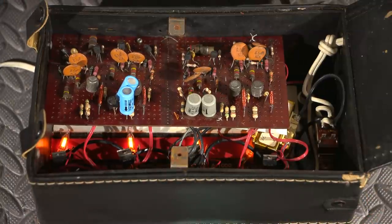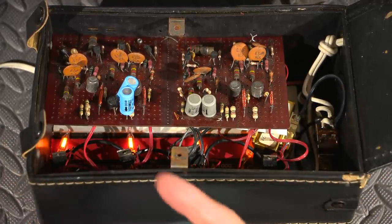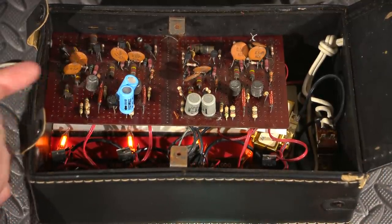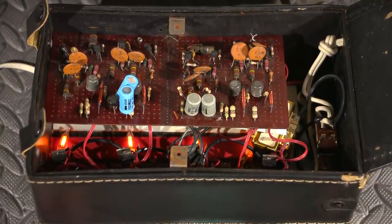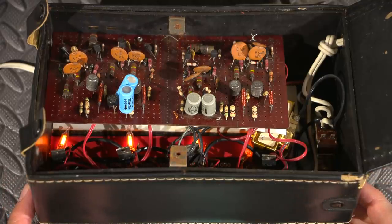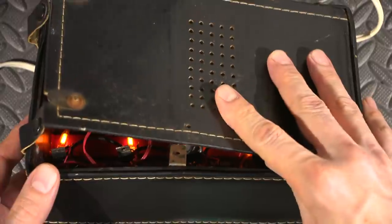It's completely random — it is kind of neat. This could be used as some sort of a light sequencer. Judging by the transistors and parts used in this — it's a mixture of carbon film and carbon composition resistors, it's got electrolytic and ceramic disc capacitors, and it's got the older diodes with stripes on them for the ratings — I would date this to the seventies, possibly the disco era. Maybe somebody was trying to create some sort of light thing, or took this portable with them, because it does seem like it has its own little box and you could take this thing portable.